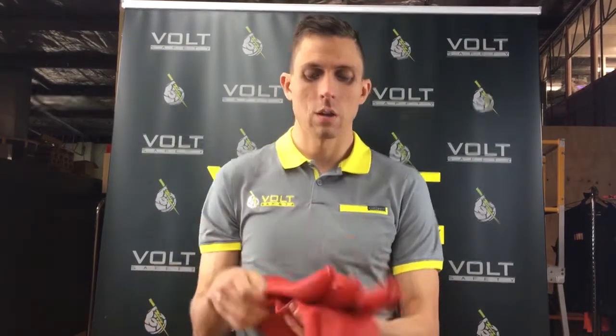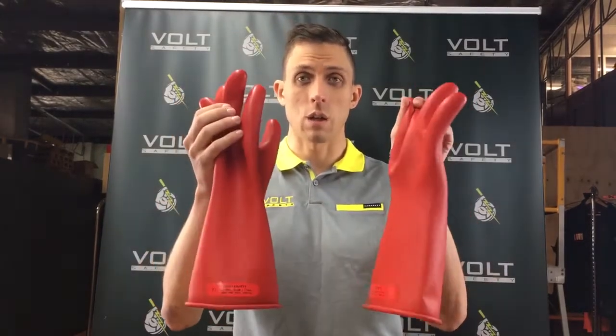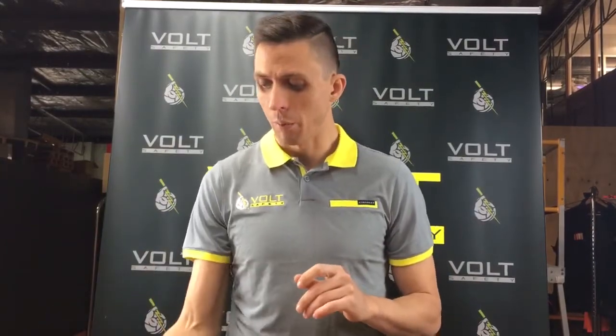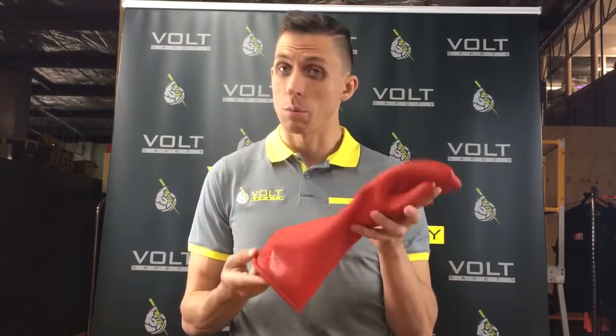Back to the product itself — the things you find in an LV rescue kit. Number one, probably one of the most important, is a pair of insulated gloves. With all our products they come tested just before dispatch. It's important that these are Class O, and they should generally be size 11 as well, so that any rescuer can wear them regardless of hand size.